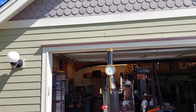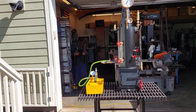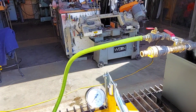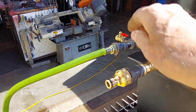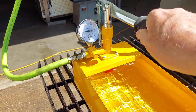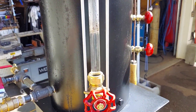Anything smaller than that is fine; anything a little bit bigger than that would work as well. This is your airlock valve right here. Open that up if you've got air in the pump. Once you've got water coming out of it, just close that off and everything you pump now goes right into the boiler. Always watch it on the sight glass going up.